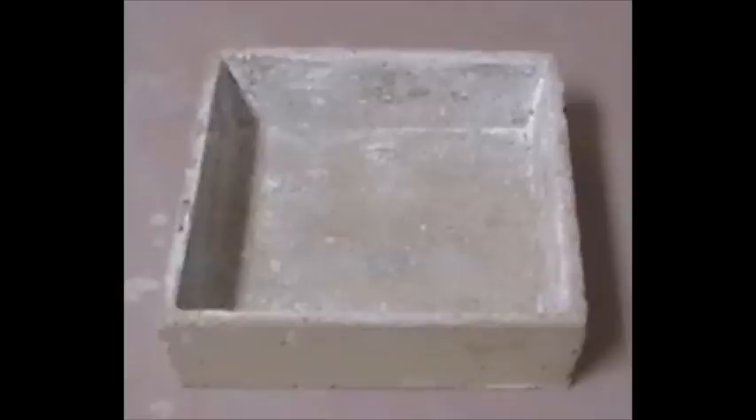Take a look at this mold. The walls are about 3/16ths of an inch thick. In general, the thinner the mold the better, because thinner molds react faster to changing kiln temperatures, suck up less of your expensive kiln heat, and thermal shock less than thick molds. Also, with castables as with clay, you want to use as little water as possible to do the job.